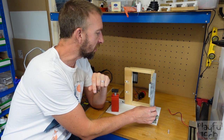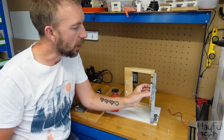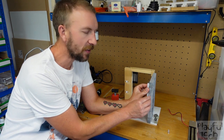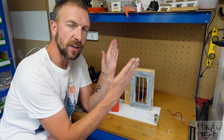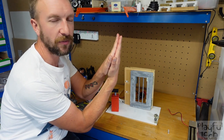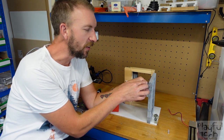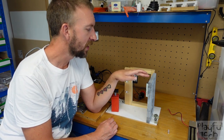Starting with the lock on the door itself — there's a mag lock mounted at the top corner with the armature installed on the door. One thing to be aware of when mounting the armature is that you want it slightly loose, with a little bit of play. When the door is brought close to the mag lock and snaps shut, the plate moves slightly to fit totally flush against the mag lock, giving the most secure bond. It seems counterintuitive, but being slightly loose is what makes it most secure.